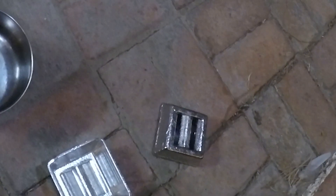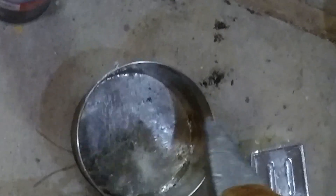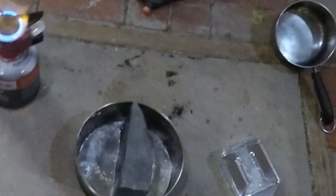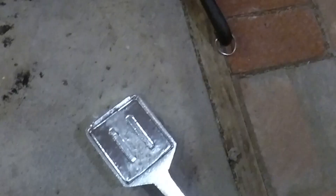As I put the saucepan back on the burner, it's kind of sketchy, floating around. I'm just trying to leave it so it can stand freely. As I try and bang the weight out of the mold, I'm being pretty tentative. I should have pre-heated that mold, just to have a more even cooling. Now it's time to get the other chunk of that 25 pound ingot melted. When I threw it into the saucepan, it splashed a little bit — that's an example of why you want to give it proper time to cool, or you'll mess up the pour.